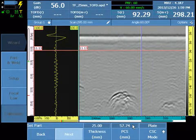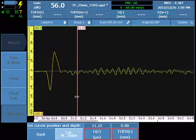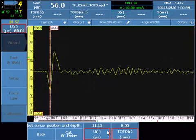The PCS will be used in the calculation. It could have been calibrated previously — as seen here — or it could be measured from the scanner. The software asks you to place the ultrasound reference cursor at the position of the target. This represents zero millimeters for the first negative peak of the lateral wave, and the time is 10.57 microseconds.